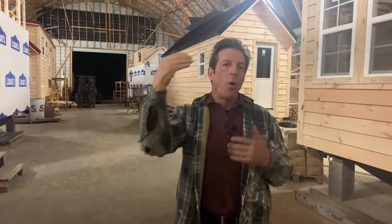Lori wants to know, is it possible to glue cedar shakes to the stucco so there are no holes in the foam board? Yeah, you can glue them. I put cedar shakes up on the foam house, the ESP home, using a finish nailer or a stapler, and I just stapled them in. If you put your cedar shakes up upright, they're not going to leak. There's no water getting to the staples. But I used adhesive too.